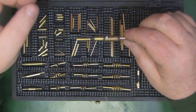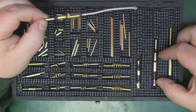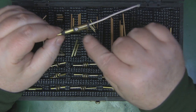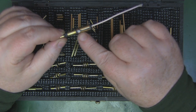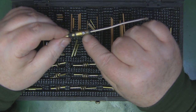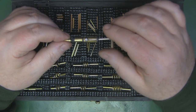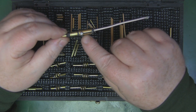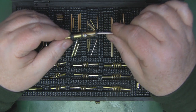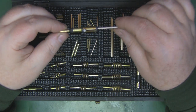And here's an example of an early version that I came up with when first designing one of these dipole antennas, and this did not work very well. Now, if you follow some of my videos in the past, you'll know why it doesn't work very well. It's because I came up with this idea here of this ground plane, so you can extend it and retract it, and I've got a little screw in there and it just runs along there, and I thought that would be a good design to use. But unfortunately, because it's an antenna, when it's extended, this slot here starts being an antenna in its own right, so it would really mess up any results on the spectrum analyzer. So although this looks good and it's a good idea, because of the slot, I couldn't really use this.